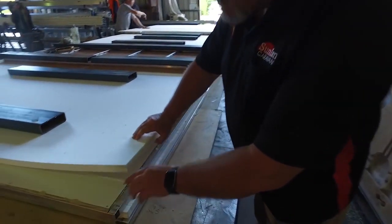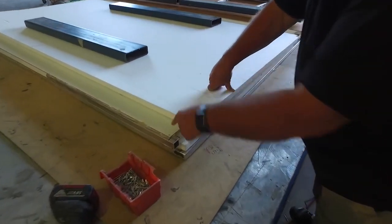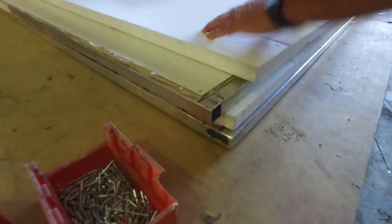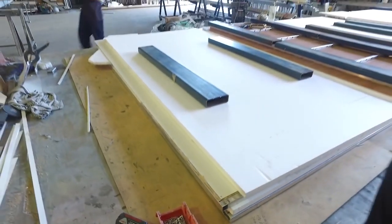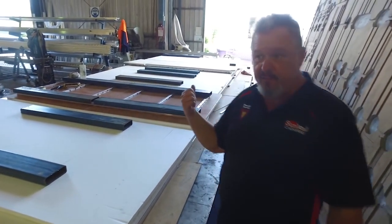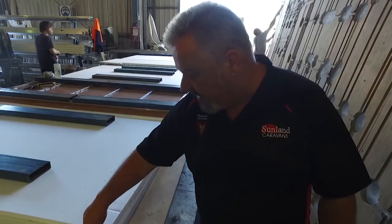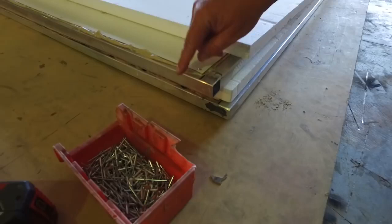Here they've just finished the wall, put it down, put the first interior ply on there. This is all laid down and pressured. Once this is set and solid, that wall is as solid as anything — we then flip that over and that goes to the other side for production. This is a solid glue, so there is no movement between the ply and the aluminium.